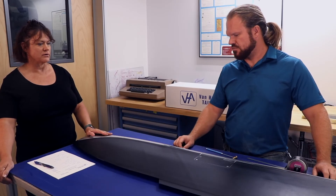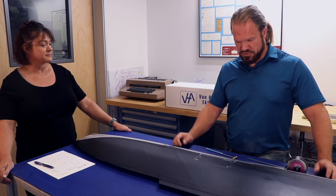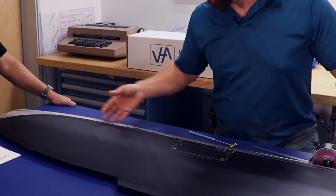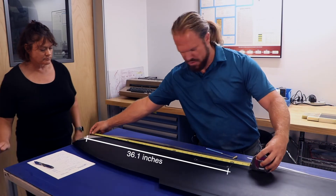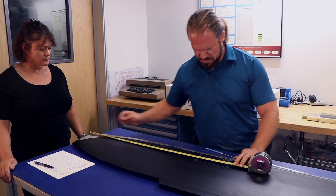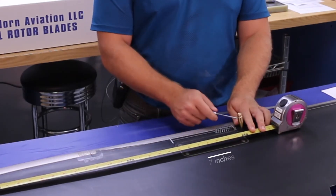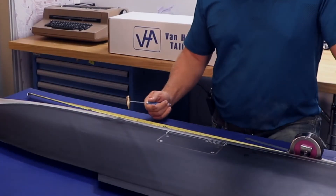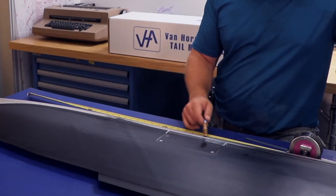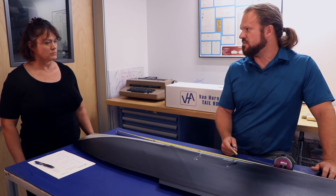So here we are in the shop and we have the 206L Long Ranger main rotor blade. We're looking at the bottom of the blade to start our tap test for the service bulletin. Can you tell us how we would get started? Sure. We're looking at the lower surface of the blade. This is the tip end and your weight pocket cover. We're going to be measuring 36.1 inches from the tip, which on the lower surface should be right in line with the inboard end of your weight pocket cover. Then we're going seven inches outboard from there, which should be right in line with the outboard end of your weight pocket cover. We're tapping from the outboard end of this area to the inboard end, specifically so that we have a known good area at the outboard end, because we know the delamination starts from the inboard end.